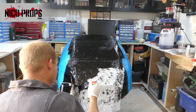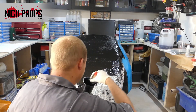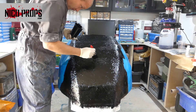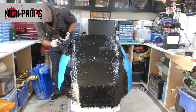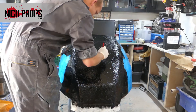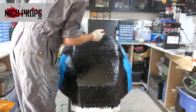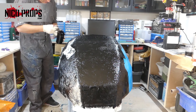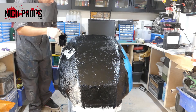I'm working my way around — once I've got the mat covered in resin I move to another area and then come back to those seams once the bonding inside the resin has broken down a bit, which allows me to blend it in on the seams. It's just a case of going around the whole thing and stippling in the resin to make sure it permeates through the material. This stippling technique also lets me suck up any extra resin with the brush — you can see it's very shiny right now — and I can take off the excess using the brush.